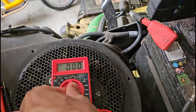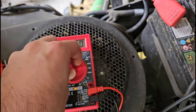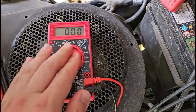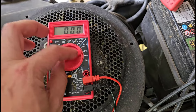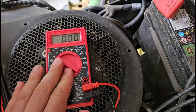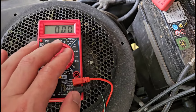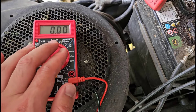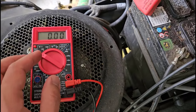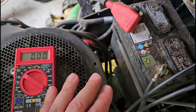Make sure you are always on voltage when measuring a battery. If your dial has an off position, turn it back to off when done. Or if it doesn't, move it over to one of the voltage settings so it is on voltage the next time you pick up your meter. The risk is: you measured current for something, left it on current, forgot, and then the next time you pick your meter up to check a battery voltage without checking the dial, you blow the fuse and short circuit your battery.